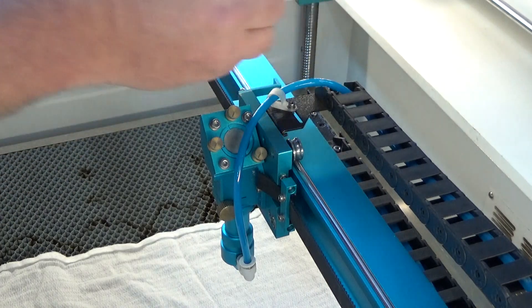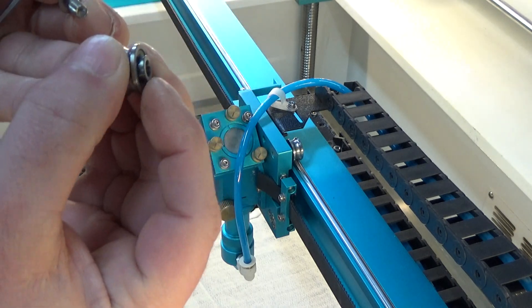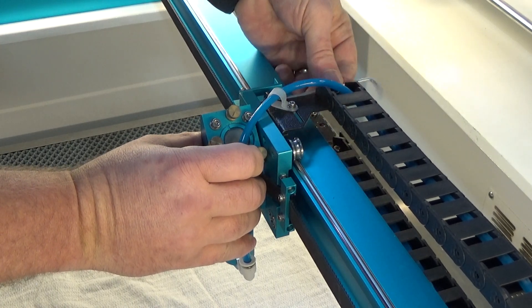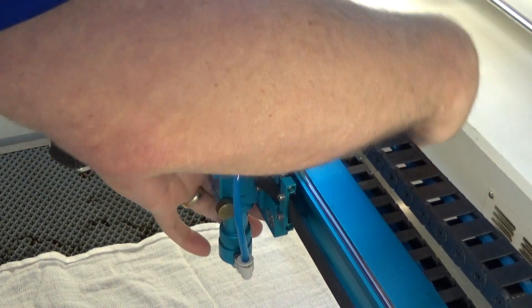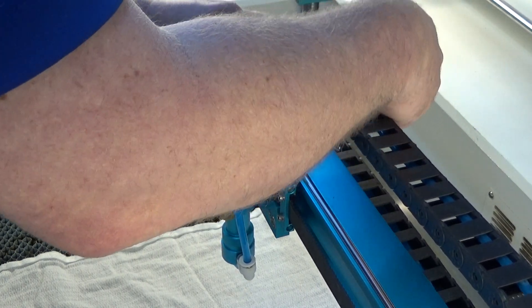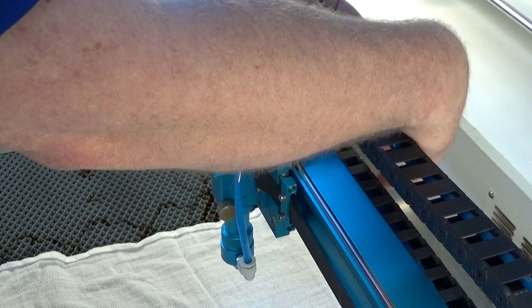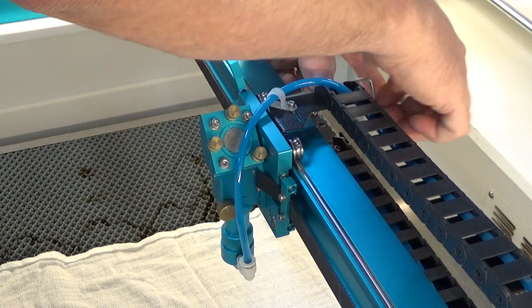Here is what we end up with: the bearing, the shoulder bolt, and if you notice, the bearing has a shoulder on it — and that goes toward the plate. I would just replace them one at a time. Be careful and not damage this stainless steel rod, this steel insert. It's probably best, before you tighten it down, to get the bearing's U-groove seated on the rod first. Slide it down — that's the way to do it. You want to make sure the bearing sits on there and then put the shoulder bolt in, and that way it'll stay where it needs to.